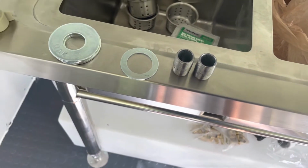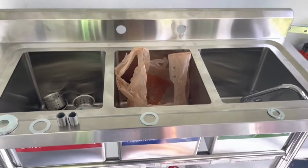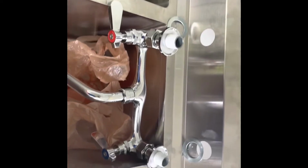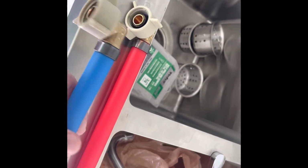It's kind of nice to have this 4-inch gap right here because I've got plenty of room to work with. So that's going to be the first step, and I'll show you what it looks like when it's fully mounted right now. And one thing I did do before going ahead and getting it all installed, you can see I got my thread seal right there around the 1/2-inch nipples, is I went ahead and installed the PEX fittings to the elbows right away.